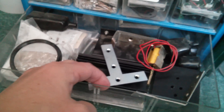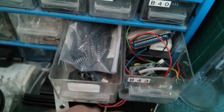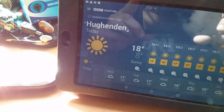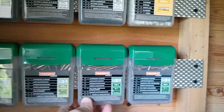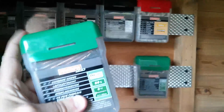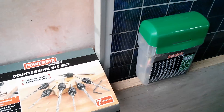So now to build this frame, but I don't seem to have much in the way of angle brackets — just one T-bracket and a few of these modified brackets. No good. Nothing in there either, so I'm going to have to think of an alternative plan. From Lidl I have these packs of screws — 60mm long. Let's take a box of these. Also from Lidl, I got this countersink bit set, so I can drill recess holes in the uprights and then screw through with the long screws into the horizontals.